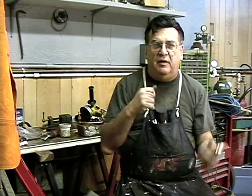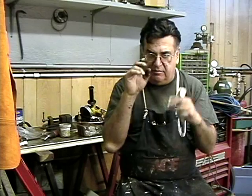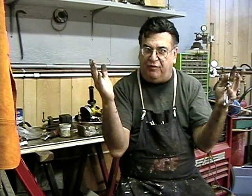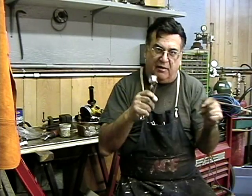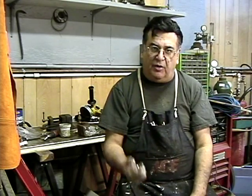I removed the piping from inside the smoke box so I could solder the back side — I've got the whole front side soldered. You have to solder it very carefully without moving the part, so it's a little tricky. You've got to carefully play the heat on one side and hope it doesn't loosen up what's already soldered.